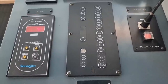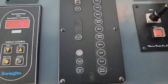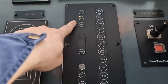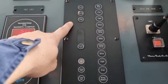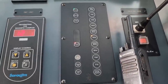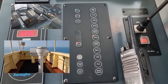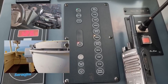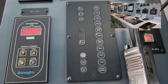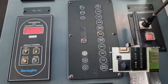We are power cycling the system here on the bridge and on the local control panel, hoping to clear the memory of the last command and have both on stop position after the cycle. We have five controls: one on the bridge control console main, one on each bridge wing, one in the engine control room, and one on the local control panel at the side of the main engine. We call this the emergency telegraph.